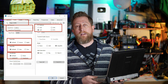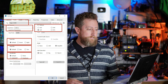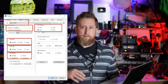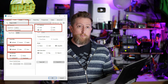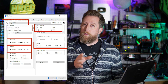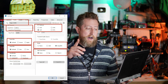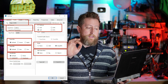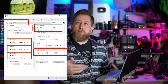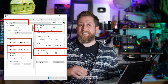On the PTT method, select CAT, because you want the application on your computer to activate the PTT for the radio and also set the frequency. Under Mode, this is one of the things I think may be wrong with the Hamlib configuration using the X108G rig type — you can use None, USB, or Data and Packet. I generally use Data/Packet or USB in the mode. For Split Operation, leave it to None.